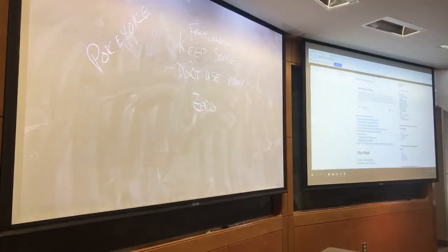So if you've got to put these two things together, make it so you can't put them together wrong, or make it so it doesn't matter if you put them together backwards. That works too. What about if we've got two side pieces on our thing? Let's make the two side pieces exactly identical to each other so it doesn't matter which side you put them on. Right? What else can we do? Let's pour out some ideas. What are we going to do to make our design more manufacturable for assembly?